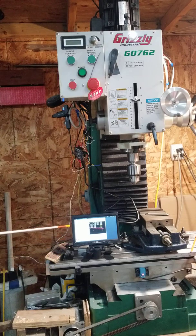I'm using a 7-inch monitor — just got that because it was really cheap and small. Probably a 10-inch would be better, but this works fine, and if you get close enough you can read it. The machine is wired with closed-loop steppers that have a fault signal — they can send a signal if a drive faults, and that's also wired into Linux CNC through the breakout board.